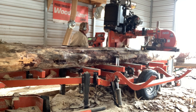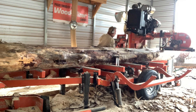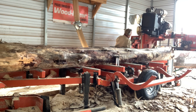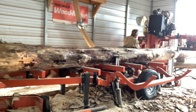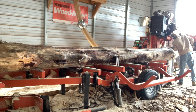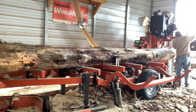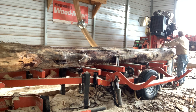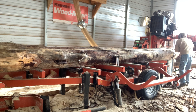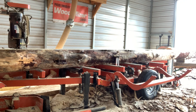Each one you have to cut all the way around — make one cut, flip it, make the next cut, finish out that cut, then slide the log forward. But once you get this long log down to a square cant all the way through, it's not that bad. You just go down as far as you can. I shut the sawmill off and leave my clamp dog open as I'm cutting — that way when I get to the end, I can just take the skid steer and push the whole log back. Here you can see this big long flitch; I'm having to pry it back with a long pry bar, which worked pretty good. Once you make that chainsaw cut, it gives you enough room to get in there.